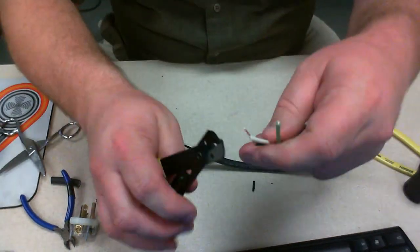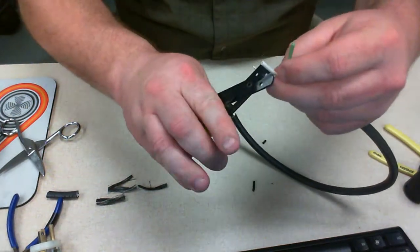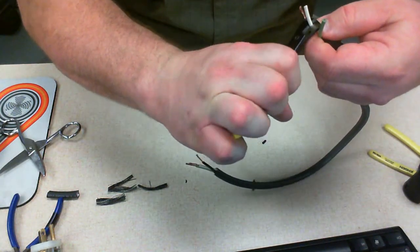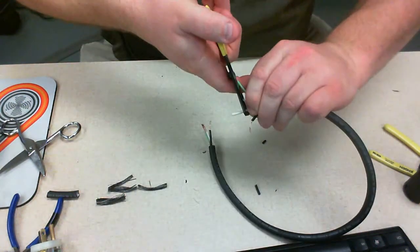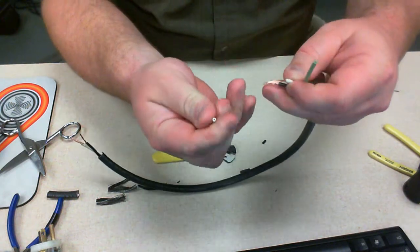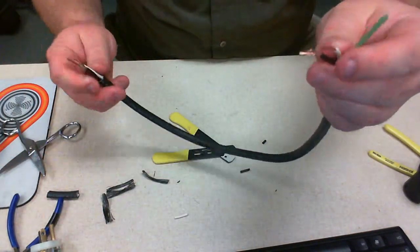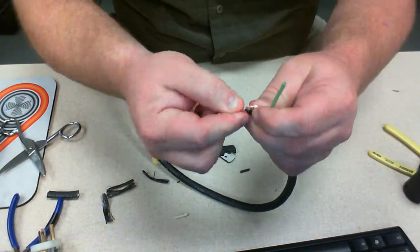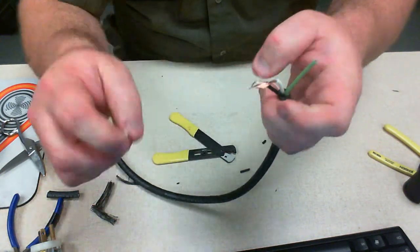What I like to do is use a wire stripper like this, and these things are literally flaking off — I'm getting little flecks of wire coming off. What I like to do is match that up, get an approximate distance, use the correct snip, and then gently snip it and sort of go around in a circle — sometimes it helps to sort of wring it. Take your time, don't be in a hurry, don't just rip it out. When done correctly, a properly stripped wire will just pull right out. Look at how much stranding I've got there in comparison to the black one — I've got a lot of stranding there. If I flip it in both directions, I won't find any burr sticking up, and if I look down in that insulation, it came off nice and clean with absolutely no strands left in there.